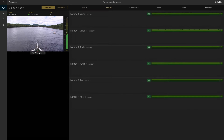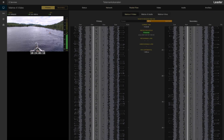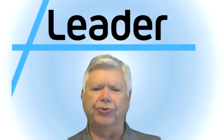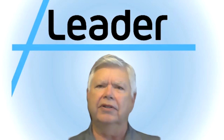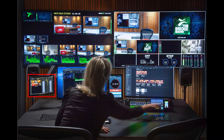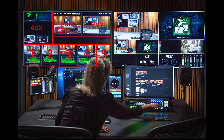The LVB440 provides an in-depth suite of analysis tools, including SMPTE 2110-20 and 21 video analysis. You mentioned earlier that IP enables workflows that we could not have even dreamt of with SDI infrastructures. Can you give me some examples? Here's an example of how the LVB440 is used, not only for analysis of the IP streams and the services with the instrument view display. As you can see, they are also using the Widgets API to create the multi-viewer display. The multi-viewer display on the left features five camera sources and waveform displays, as well as a program and picture preview, and other auxiliary feeds.